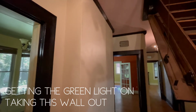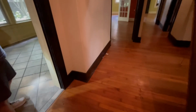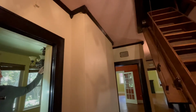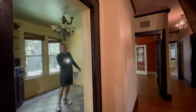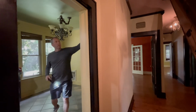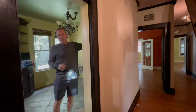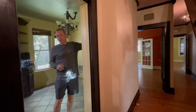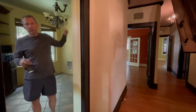Well, do you see any problem structurally though if we do take this out? That's not structural. I didn't think it was any problem. The only thing we would want to look at is when you take it out, since this is an opening, there should be a header across the top up here, and supported, and it's kind of that span. Those loads are going around it and down. Right. So if you take it out, we need to look to make sure that there's an adequate header in there for that span. Or would you just put a wall back? We probably would just fill it in with the wall. I haven't really got that far yet. If you want to open it up, that's whenever we need to look at the headers and the loads, all of it.